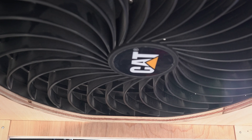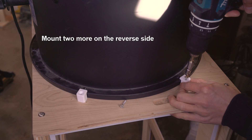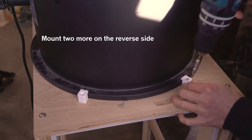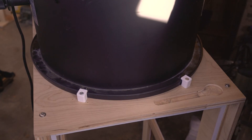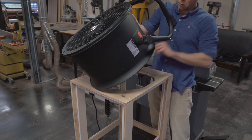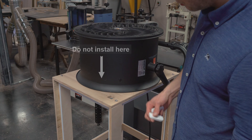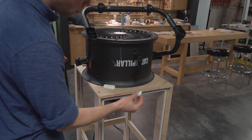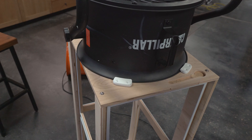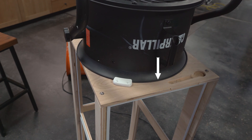Be sure to center the fan on the filter box prior to installation. To mount the fan in the push direction, use these four 3D printed brackets. Drive the screw into the surface of the wood or pre-drill the hole with a 1/16th inch drill bit. Now to mount the fan in the pull configuration, you will feed the cord through the hole and center the fan. The fan can be mounted with three of these brackets. If you are going to mount the filter on a wall or the ceiling or any other non-standard application, you will want a strong connection between the fan and the filter box. Be sure to screw these in at these locations. If you mount them at the top of the curve, the screw may pass through the top into the filter area. You do not want that.